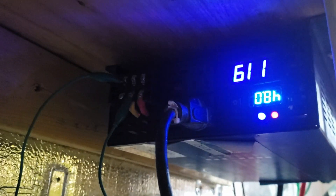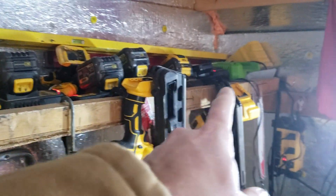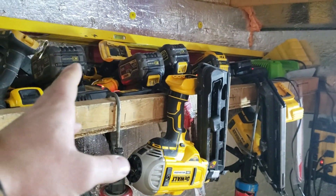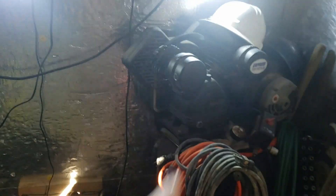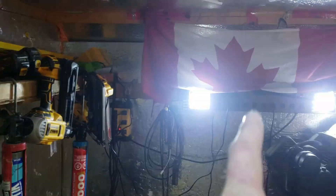And it's working great. I run a little compressor off of it, as well as charging all these batteries — they're 100 watts apiece, approximately. I do not run the large load, as that will blow the inverter up. I charge my power pack which runs the diesel heater, which is running right now, and I'm currently running the microwave and the lights. At this point I would not turn that on, because that would trip the inverter.